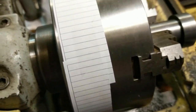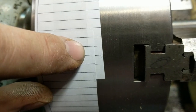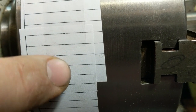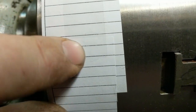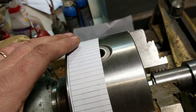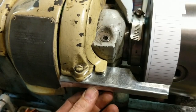There I have a continuous strip of lines long enough to reach all the way around the circumference of the chuck. When I wrap it around, the lines should line up — and here it is. At the transition you can see it's lined up well, certainly within a couple thousandths. Right where they actually join they're dead on, and when you back out the error of a couple thousandths of an inch, you're not going to be able to tell the difference.